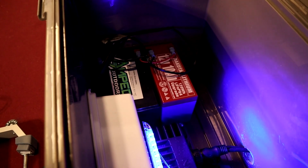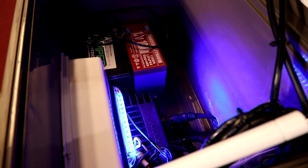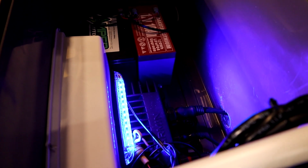And something else really quick, part of the brains to this whole system is the Garmin Black Box that you see down there at the bottom. You got to remember, this is a dry box. It does have a couple little spots for water to get out in case you got water in it, but we also have this Garmin Black Box elevated about a half inch off the bottom to keep water from getting onto it. If this does happen to get water in it, it should be able to go out these holes before really affecting that box.